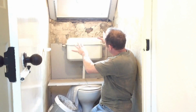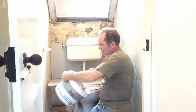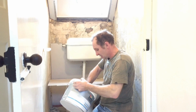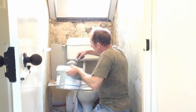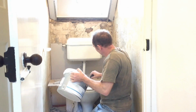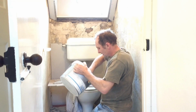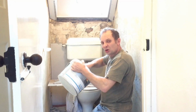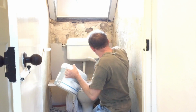Right, and I've just got this last bit of board to put on this top section here. So I've mixed up the board adhesive. I'm basically just going to put a few dobs on the board, like so. Being pretty generous with it, because it's a little bit sloppy, as they say. I've not mixed it too thick.